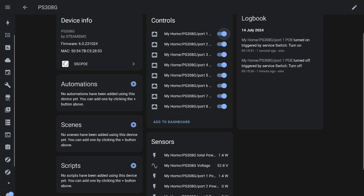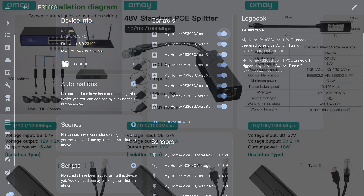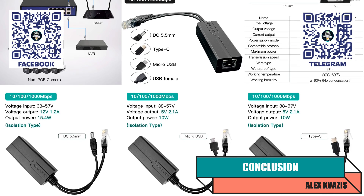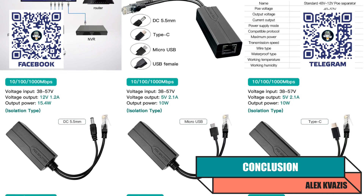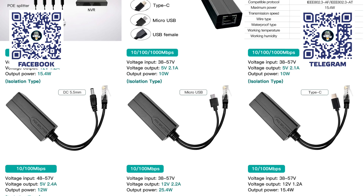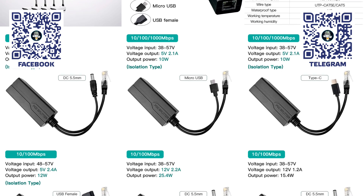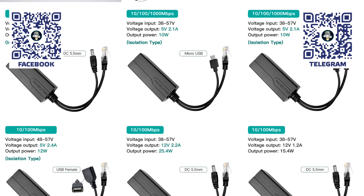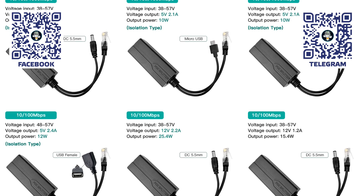For example, if you use IP cameras powered by PoE, you can use the status 'unavailable for one minute' as an automation trigger. If this happens, the automation will reboot the camera via power. Also, PoE can be used not only to power devices originally designed for it, but also many other low-voltage gadgets like mini PCs, screens, and non-PoE cameras. For this, splitters are used — adapters that connect to a network cable with power, an output standard Ethernet, and a connector with the required voltage, for example 12 volts or 5 volts. Ethernet itself is not necessarily used; you can simply take the power.